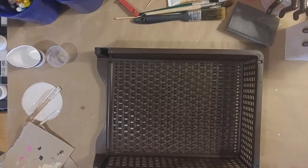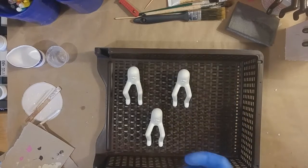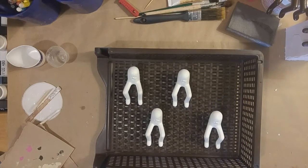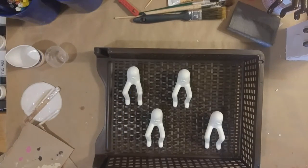This is of course because you can't go back and do these things after you put paint on it. So with several pieces prepared ahead of time, I set them down on these little dollar store racks — which you can see already have paint on them — and set them up to be sprayed with filler primer.